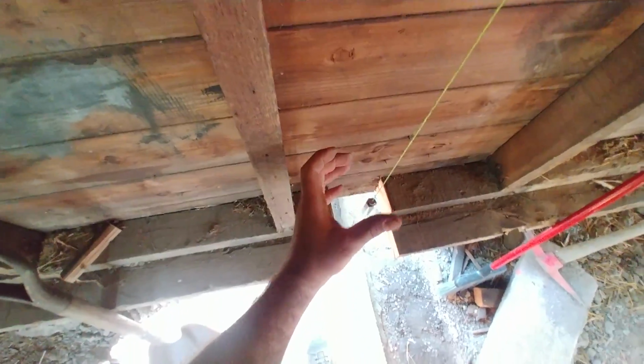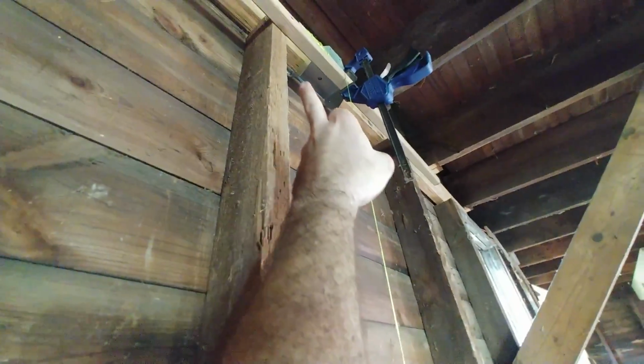I got to get this plumb bob out of the way. And then I will come in here and put it out through the hole, tip it forward, set it down on the foundation. It'll probably be tight going into the bracket, so I'll take this up a hair, get it in there, bring this down, and then I'll nail in the two ends of that bracket.